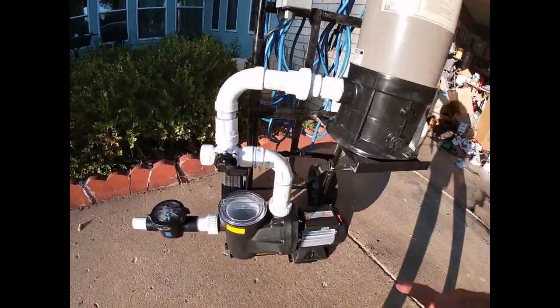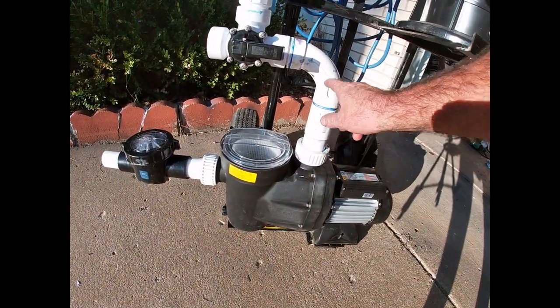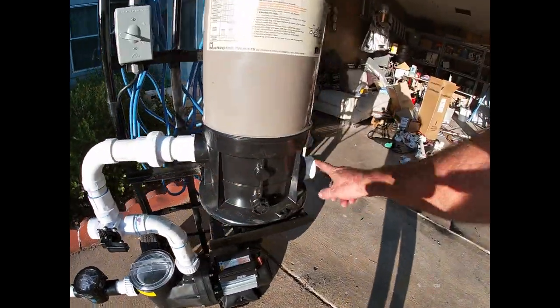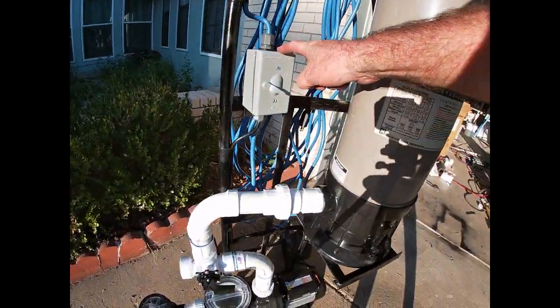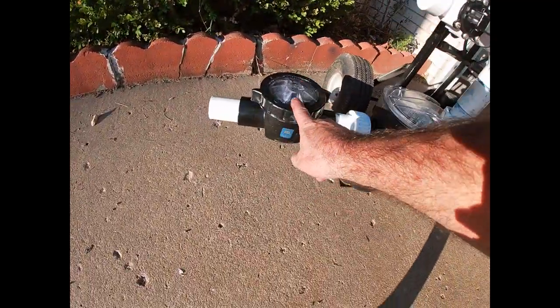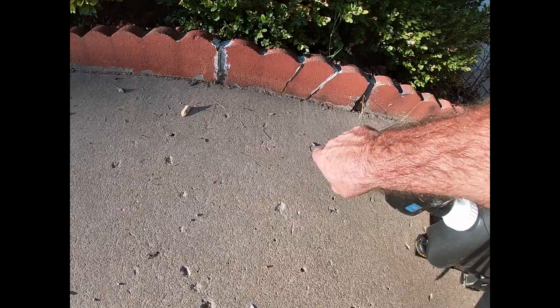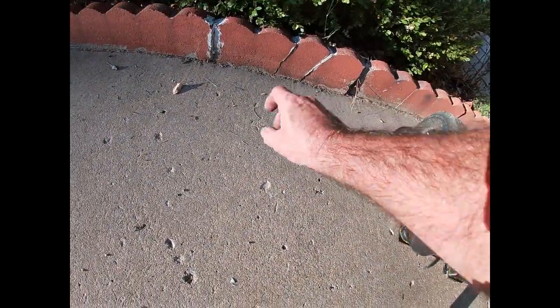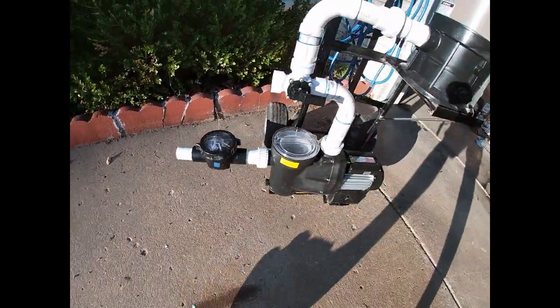It's the end of the day. Still haven't finished but I got a lot done. I've got the pipes connected — this is all inch-and-a-half to the three-way valve: waste, to the filter, exit. I've got the electric on, a 50-foot extension lead, and my check valve. I found that if I file the inside of this out, the pool hose will slide in there and with the vacuum it'll hold in place. I'm about ready to check this out and I'll do a video on that.